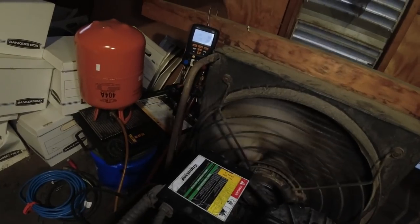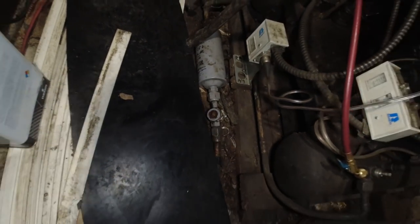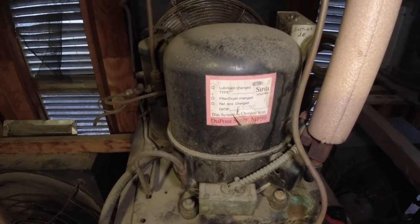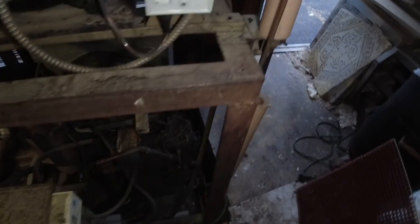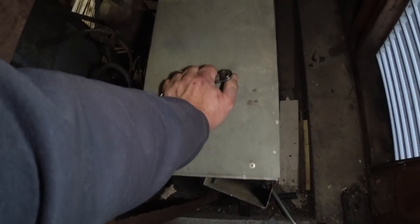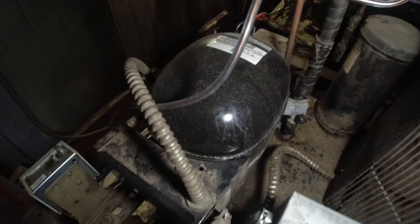So, 18 pound suction. Yeah, we'll go back in, double check that. I'm sure we'll flash off. Just can't really do much until we get this thing to optimal conditions. You can see some of the other equipment's fairly tired. A lot of the noise is just that fan shaking the crap out of it. Enough to drive you nuts. Looks like a compressor was replaced in 20.